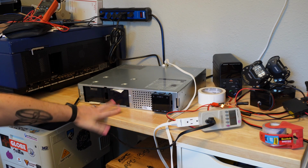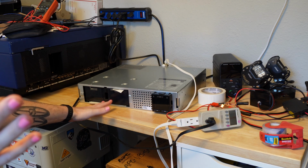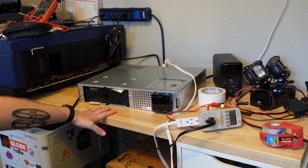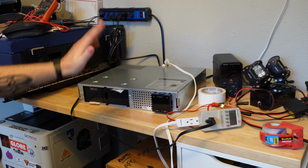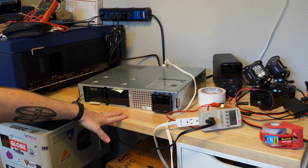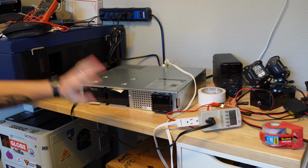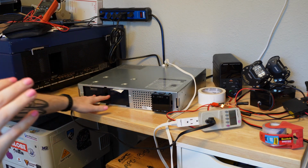I haven't tried testing them beyond about 1 amp, so I don't know how much the voltage drop ends up being. It's like 2 volts at 1 amp, which I'm not sure what it should be. That feels kind of high to me. So I think you put load on the batteries, voltage on them drops super fast, gets too low, and the thing dies. There's one thing that has me a little worried. And yeah, I know this whole thing with trying to run it on these dead batteries, I'm being dumb. I'm being dumb even trying to do this.